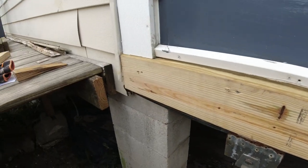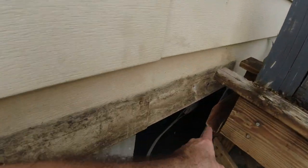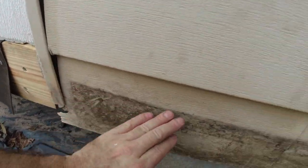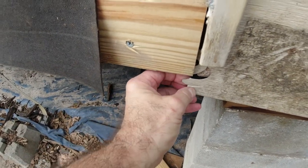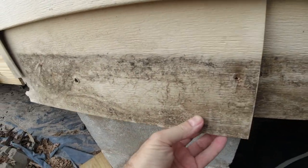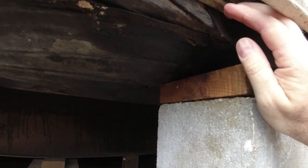The next thing I'm going to do is get this deck board all the way from here to there. There was one board here that I don't think I need — it might have just been decorative. Don't use a circular saw when you cut the siding because it just breaks. This j-channel section isn't hooked on at all — it's no good. The j-channel got stuck behind there.